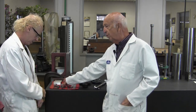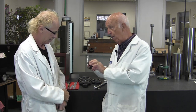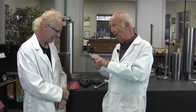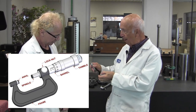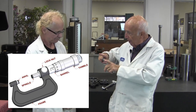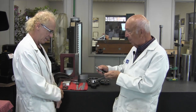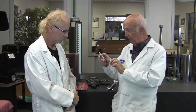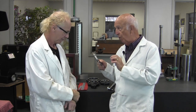If we want to get a little closer, we could use a micrometer. What I like about the micrometer is that it's absolute. I don't like anybody to borrow my micrometer — I do have micrometers I will lend out, but not this one. This is called an anvil. If somebody drops it and bends it, it's out of parallel and you can't get a good reading. You might as well throw it out. They can lap the carbide tips and repair them, but it's not worth it. This particular micrometer does have carbide tips, which don't wear as frequently as metal — there's a lot of longevity in carbide.